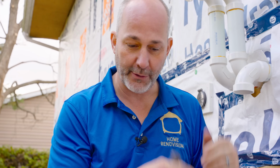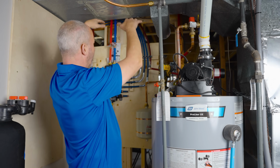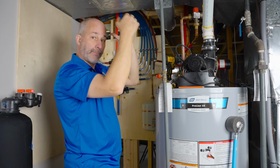where we're going to be doing our surgery. And in my case, the only other option is a hot water tank. So you could put a pail under there and pull that release valve. That's another way to release the pressure. All right, so the last step is, if you consider this, we're going to be cutting at ceiling height here, and there's a whole spider web of pipes. So we want to not just release the pressure, but release the volume.